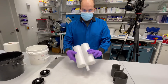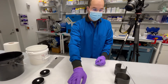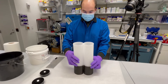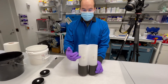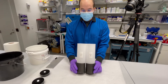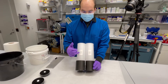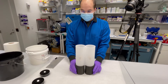To get started, hold the cartridge properly — you don't want to fill it like this because it'll fall over. We have these little holders that we made, available on Thingiverse if you need them. I highly recommend labeling the different sides part A and part B so you know which side you're pouring into. I also recommend putting the lot date of the silicone material and the date that you're filling it, so that you use the most fresh silicone possible.